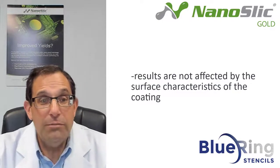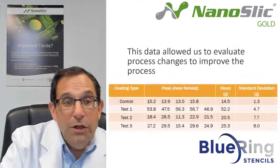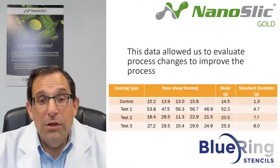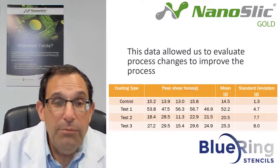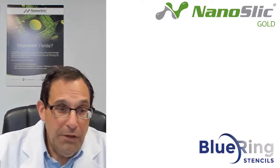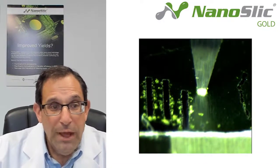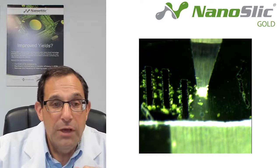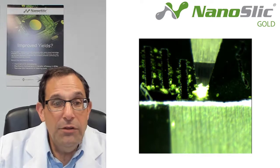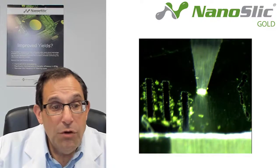Another aspect of the testing method is that it's not affected by the surface tension or the hydrophobic, oleophobic properties of the coating itself. So knowing this force in grams required to lift the coating from the stencil surface, we can now evaluate changes in process, changes in surface prep, changes in chemistry to see how it affects the coating's durability. In this video, you can see a force is applied to the scrape tester probe as it moves across the coated surface. Then the force in grams is increased until the coating begins to lift, as you see in the video, and then this force in grams is recorded.